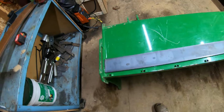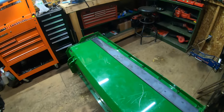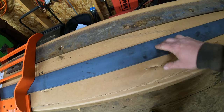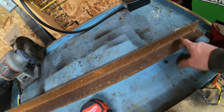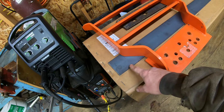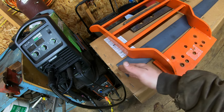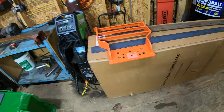As far as the skids go, they've got square holes so you could use a half inch carriage bolt. When I go to build the skid, I plan to build them the exact same way I built them on my push box. I've got a piece of quarter inch by three inch wide flat stock for the skid mount — that's going to stand up vertically. I've got some hardened steel over here, two by two angle iron. I plan on ripping this in half with my plasma cutter and using a two inch strip as the bottom of the skid shoes. When I cut the skid mount to size, I'll cut it with a curvature so it's got a rounded corner, and I can beat it with a hammer to fold it up so it's ramped — that way if he goes to hit something, it'll ride up over top of it.